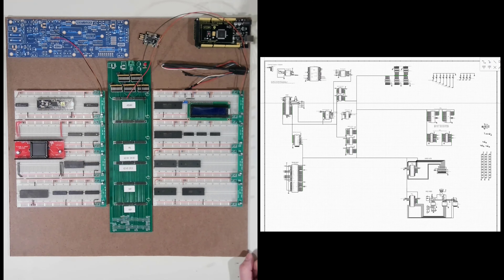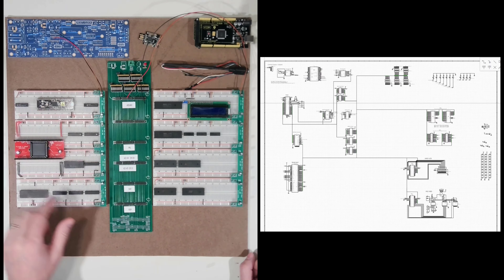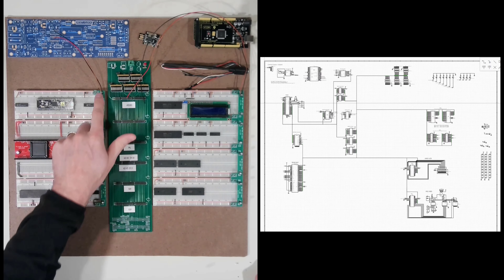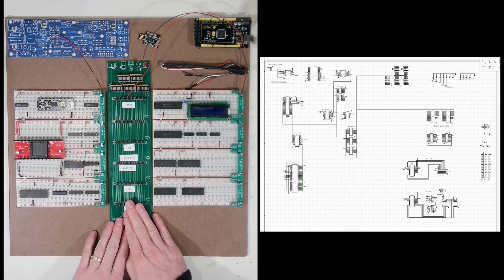Usually my concerns are more with the pins on the breadboards than anything. I will get the power distributed that way. You will also notice that I have put a pair of caps or capacitors at each of the power connections — a 0.1 and a 0.01 microfarad in every power location. Might not be entirely necessary, but I found that that's helpful. And on the rails I have some electrolytic capacitors, simply 10 microfarad, so every rail should have its own 10 microfarad capacitor. It should be good for power distribution.